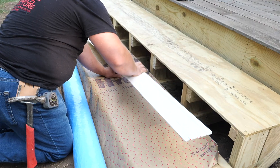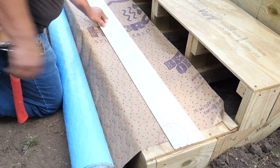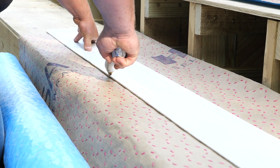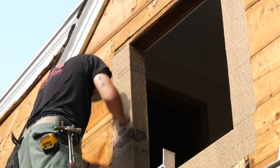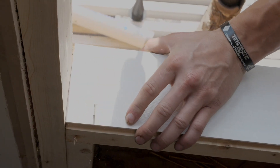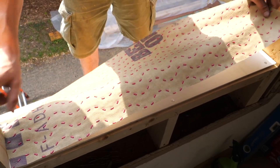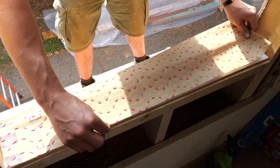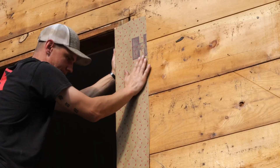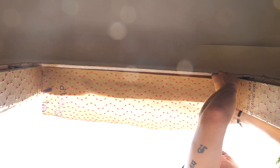You can see that the felt's not very good at stopping air infiltration to the home. Same thing with these big wide tongue and groove boards — they're beautiful, but they are notoriously leaking, especially as things get pieced in around the windows. So we're going to wrap this house in a self-adhered building wrap, starting with the window openings. Joseph cuts wide strips of HydroGap with a system where he marks the step to align a straight edge after butting the HydroGap into the riser. Stephen then air seals the window opening, beginning by tacking a piece of siding to the bottom sill to push any water that leaks in out and away from the wall. He peels his strips, placing them on the framing, bridging the sheathing all the way back to the framing to eliminate air leak pathways, sealing the sill, jambs, and window head.